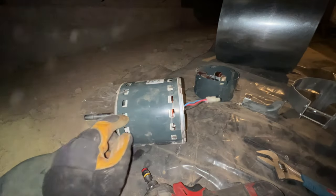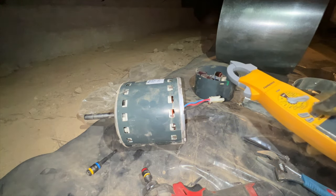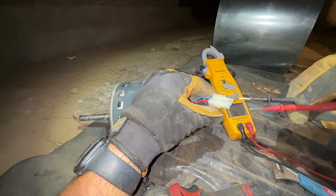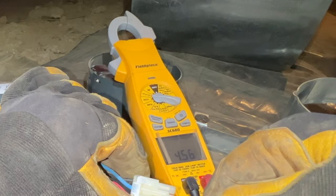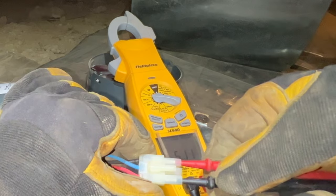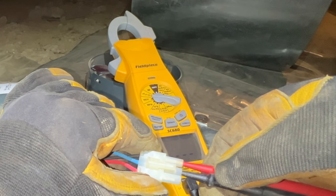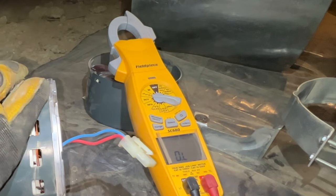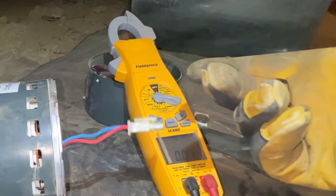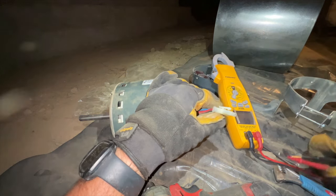The module is no good but the motor is probably still fine. Since it's a three-phase motor, we can ohm out all three legs and we should get the exact same reading on all three. Red is one, blue is two, black is three. One to two: 4.58. One to three: 4.58. Two to three: same — about 4.6 ohms. So this motor is probably fine. You test it just like a three-phase compressor — all three legs should be the same or at least close to each other.